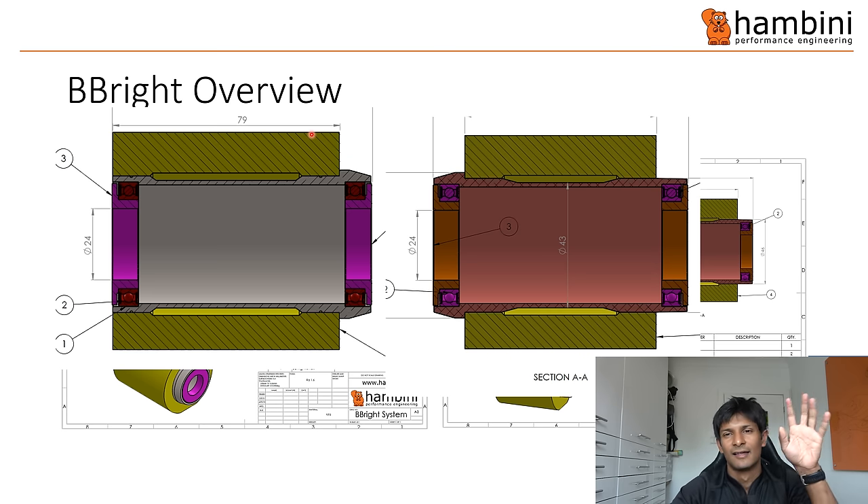There are a few odd aspects to cover in this solution. First, the choice of bearing — by default I'd get NTN or even NSK for this application; some NSK bearings are made on the same production line as NTN. For the body, a modified install procedure with bearings at the end, and a racing spec body because it's stiffer — the normal classic spec is not as stiff, so this really needs a racing spec. The fit is calculated with FEA, but you could use a hoop stress calculation — assuming carbon fibre epoxy strength of 60 MPa and working out the stresses from there.